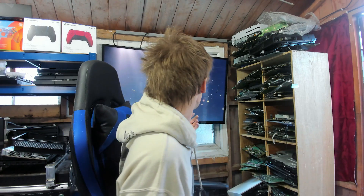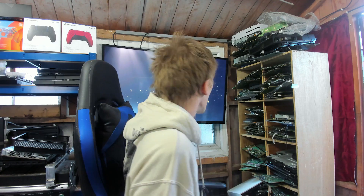The customer cannot be to blame for an HDMI port snapping and falling out — that's my fault. I obviously didn't put enough solder through the ground holes and that's a lesson learned. By replacing the port again, I've also had to replace a couple more traces that were weakened from the initial impact damage. It appears to be working fine in 4K. I hope this gives you an insight into when and how to handle warranty repairs.